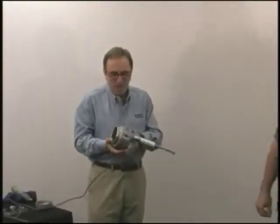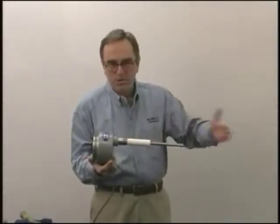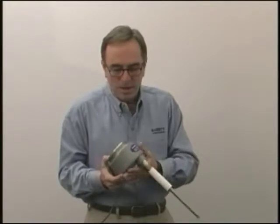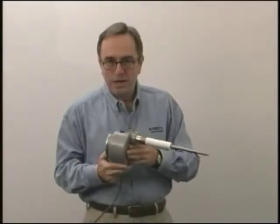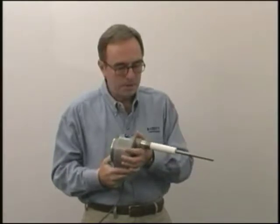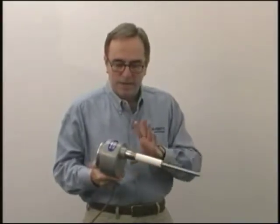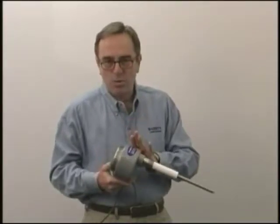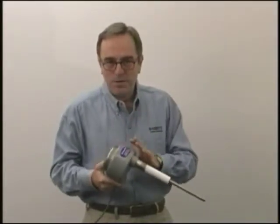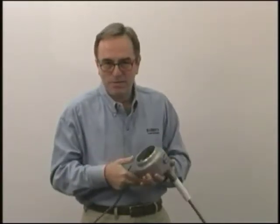This has the widest tuning range of any switch on the market. That's why these electronics will power a probe from a fraction of an inch long to over 150 feet long. By the way, this unit is a direct retrofit for a rotating paddle-type unit, frequently used for dry bulk solids. It has the same exact control wiring, so it's out with the old, in with the new. There are no moving parts in the vessel, no paddles to fall off, bearings to wear out, or motors to burn up.